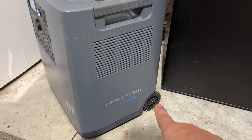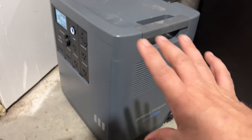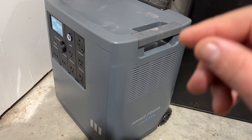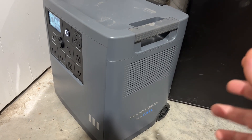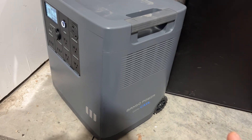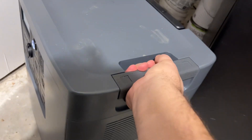Because it's starting to get heavy when it's this big — it's 3,000 watts of inverter and 3,500 watt-hours of battery storage, so 3.5 kilowatt-hours with a 3,000-watt inverter. It has an extendable handle on the back that comes up so you can tip it back on the wheels and move it around, so you don't have to carry it by hand.